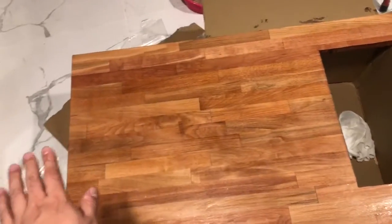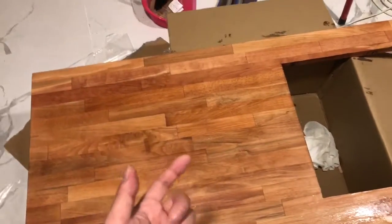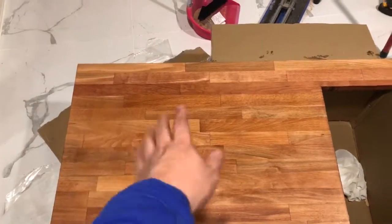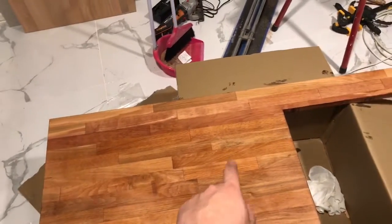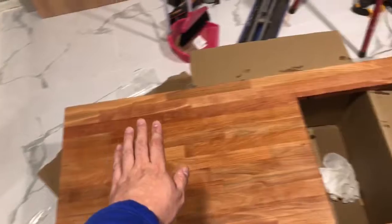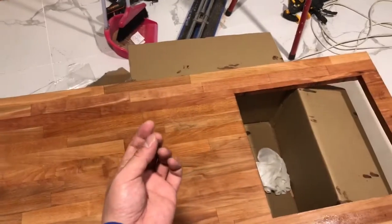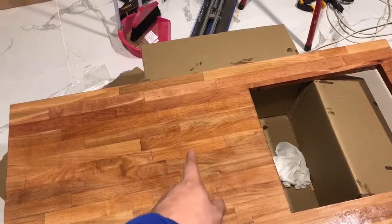When you coat epoxy on solid wood, it pushes the bubbles out, so bubbles come out of the wood, which is porous, and after the epoxy is cured, you have an unsmooth surface with little bubbles. Once the epoxy becomes viscous, the bubble would not pop. The bubble will be sealed inside the epoxy.